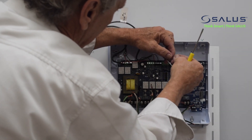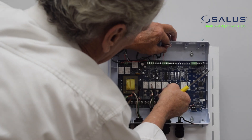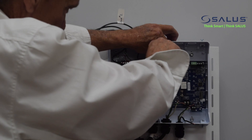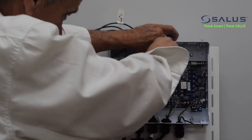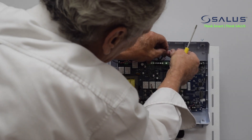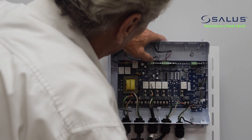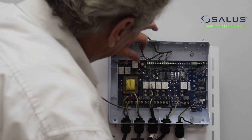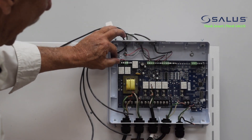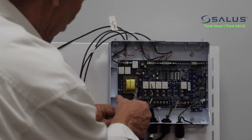And now we're on thermostat three. There's plenty of space on top of the panel so you have room to move the wires — you don't have to bunch them all up into tight groups. So basically you have the wires for the three different zones there and the signal going back to the boiler. Next thing to do is move on to actually powering up the unit.